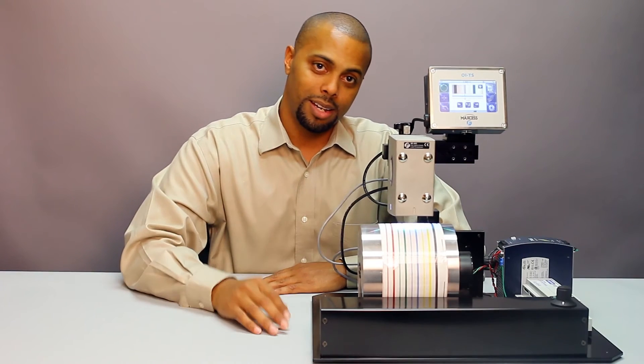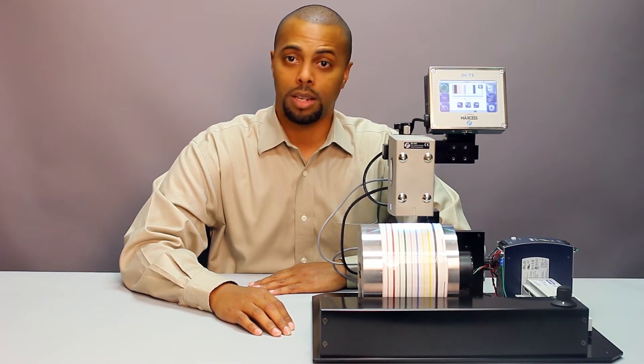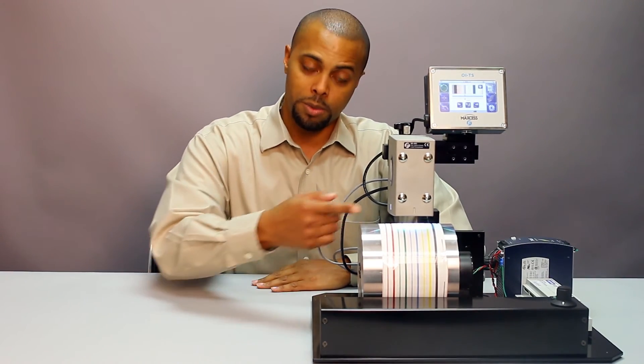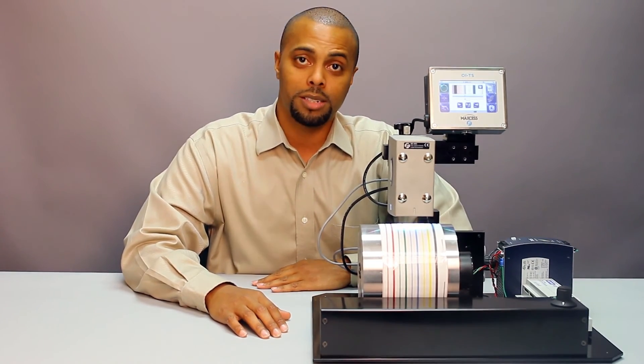The calibration is now complete. The SE46C digital line guide sensor is capable of detecting line, line edge, and 2D graphics like barcodes. It has easy reference selection via the OITS color operator interface and can display the field of view image in full color. There's a wide field of view of 30 millimeters. It has an analog output of 0 to 10 milliamps and is IP54 rated for protection.